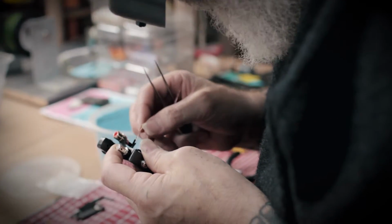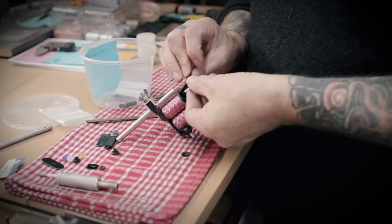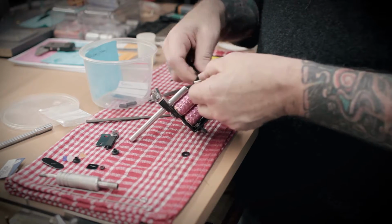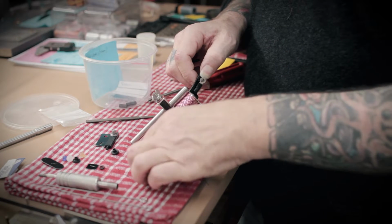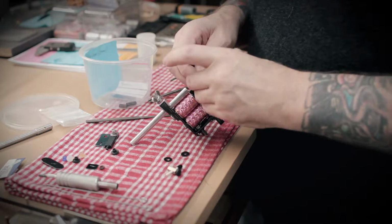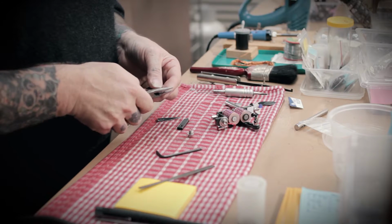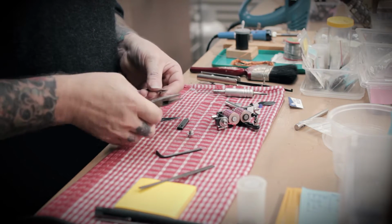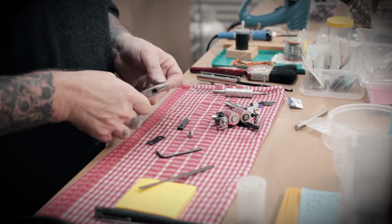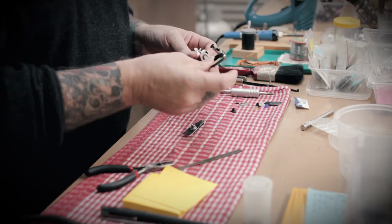With the top binding post positioned, Colin fits a tube blank into the machine. He'll then look down the side of the tube to double check that the contact screw is aligned to the tube. If the screw isn't aligned in the center, he'll use shimming washers to space it back into alignment. The fitting of the armature involves attaching springs. Colin hand makes his own springs using his own method of cutting and filing, fine-tuning them into fitting the frame correctly.